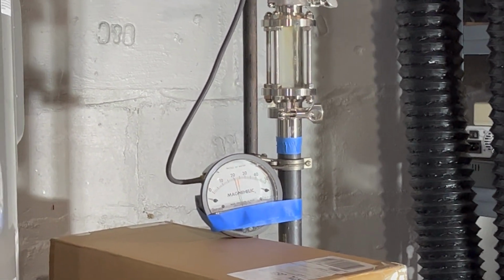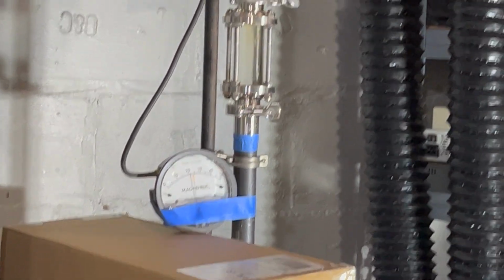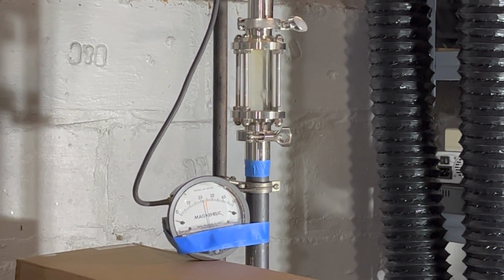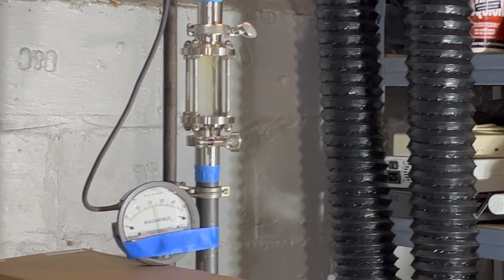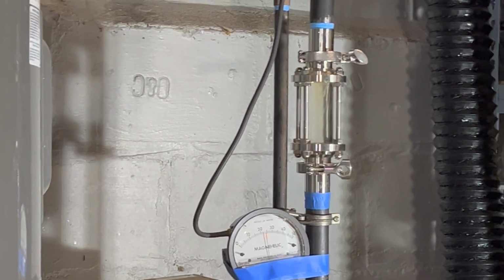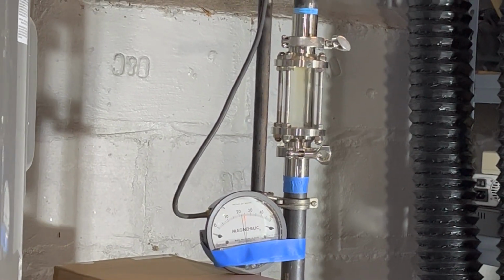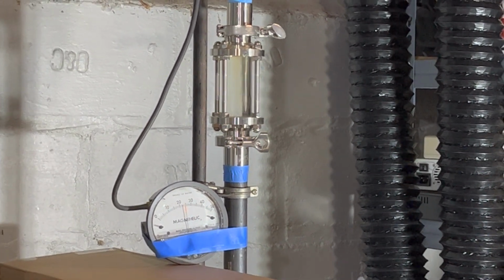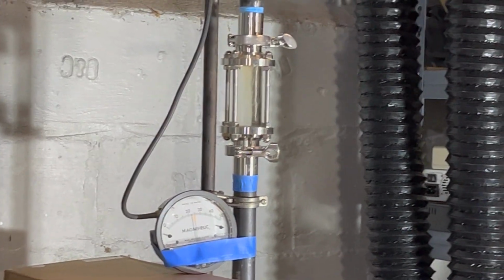According to what the general feelings are out there in the industry, by closing off the equalizer, it should allow more water to be pushed out the back end of the boiler into the wet return and force the water level higher over there at the far end, right? That's what we've been told in The Lost Art of Steam Heating. And we should be able to see that.